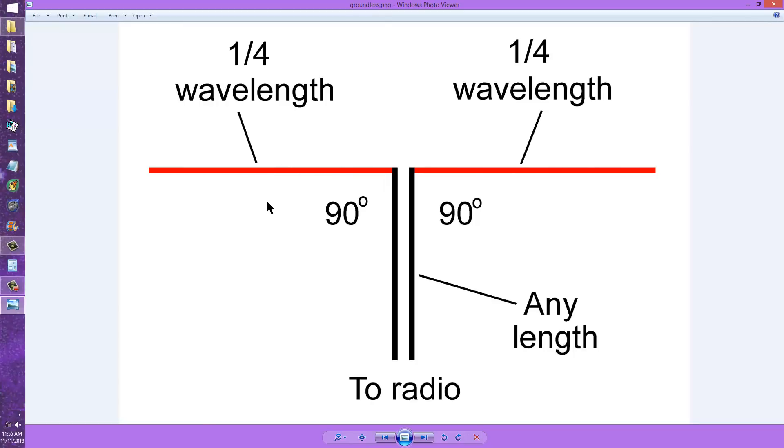I've shown here a simple example of a one-half-wavelength dipole antenna, each leg one-quarter of a wavelength long, fed with balanced wire lines such as ladder line. For a generalization, let's say that we're on HF — high frequencies — that means between 3 and 30 megahertz. Then these two wires should be a tiny fraction of a wavelength apart on any frequency.